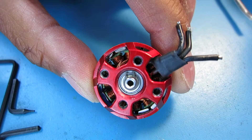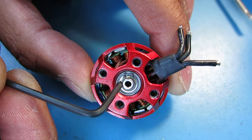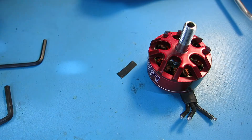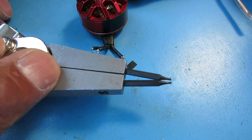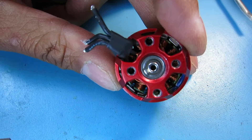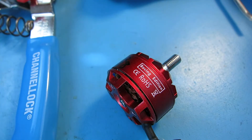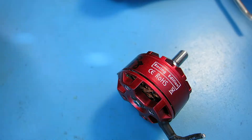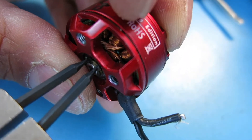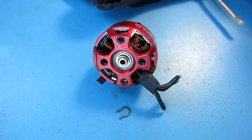So what I'm going to do is work from end to out. What I'm looking for is, on the bottom of the motor, the little clip — I'll point it out right here with the Allen wrench. Here's the clip right here. So I'm going to install the smallest spreader. I had to install the straighter versions just so I can get the tips as close together as possible so that it would fit inside the clip for the motor. Let me put on safety glasses, slide that clip, and spread it just very slightly to get it off — and there we go. Hopefully I didn't damage that clip too much and I'll be able to reuse it, but I'll order some new ones.